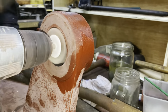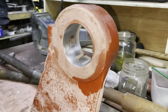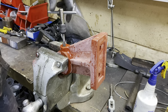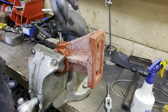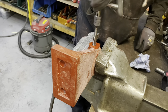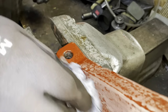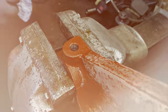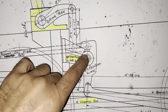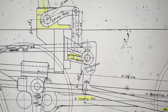This is just skimming out the primer that's been put on by the shot blasters — it's really tough, but we needed to get to the actual metal surface to see what we were dealing with for skimming for new bushes. Here we're cleaning the threads for the lubricator oil pots with a tap, essentially just cleaning off that primer, which was rock hard — really good for protecting the surface down to the clean bare metal, but a nightmare to remove. This is the drawing — a general arrangement — actually the Bundaberg drawing rather than the Fowler drawing because we didn't have an accurate Fowler drawing.